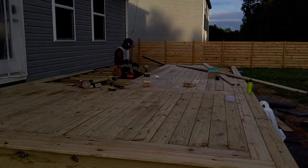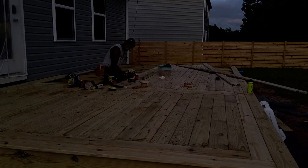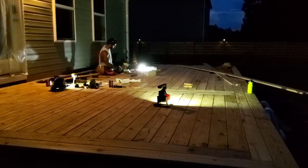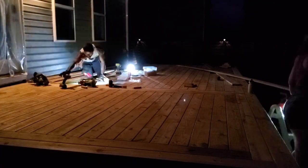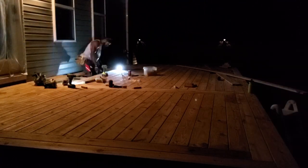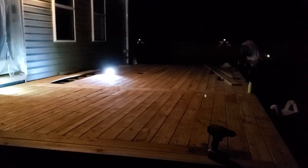We had a saw guide, which means you can lay out all the boards, and after that, you just use a saw guide and make a straight line. You'll see us use it after this, probably the very next day. It's pretty straightforward. It has two clamps on either side. You just clamp it on and hold it with a bunch of clamps, and then you mark it, or you could just use your circular saw as a guide to cut it across. As I said, you'll probably see it when we're about to cut it.